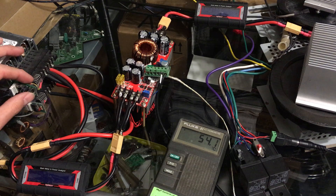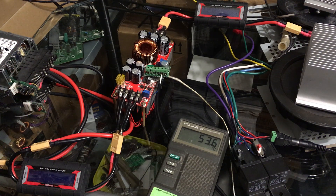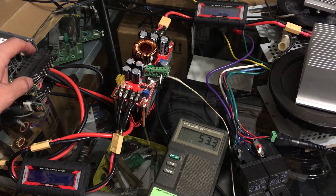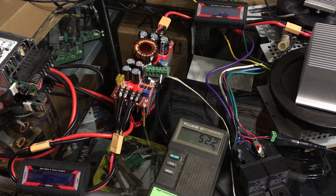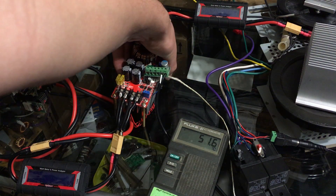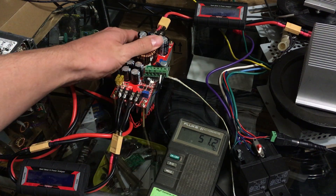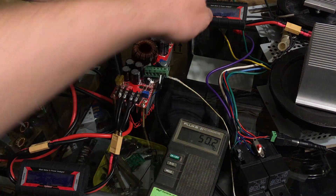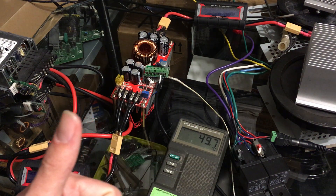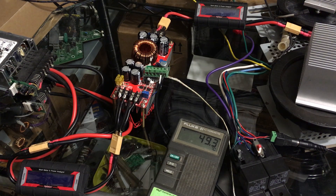Okay, that should be all the way down. Watch the lights flicker — yeah. The lower voltage one — the one that gives 12 volts versus the other one that gives 24 that add together — this one is tripping. So I do believe we blew it up. Yeah, this heat sink is warm. I won't get to know what voltage that was because I wasn't paying close attention, but I'm pretty sure I saw 800 watts on here. I will give you the rundown in the comments after I view the footage. I'll see you guys in the next video.